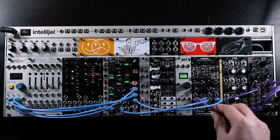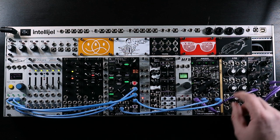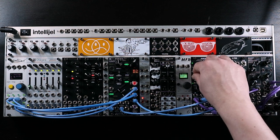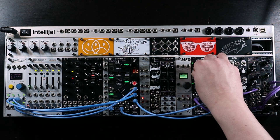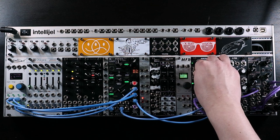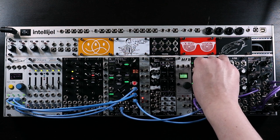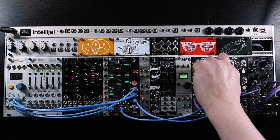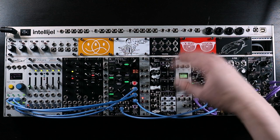This drum loop is plugged into VCA 4; I've taken VCA 4's output to my rack output, and the mix output is plumbed back into VCA 1. As we bring up the level of VCA 1, we start to get real character — the prominent resonances inside the loop become more and more enhanced, we get some lovely crunch, and eventually some tone. Anything we plug into the other inputs will also get put into that feedback loop, so with a bass line added, those signals will fight with each other, getting crunchy and grungy.